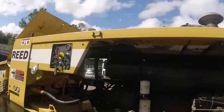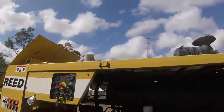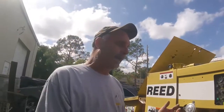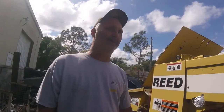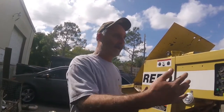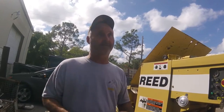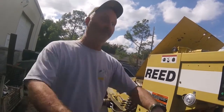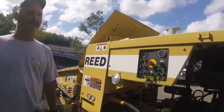That way it cleans, and you have the right pressure. The machine's running correct. Because what will happen is that at some point the pump's got to convert. It's called a point of regulation on a pump. It's usually about 100 bars, somewhere around 95. But when you run it at half speed, the pump now tries to convert for you. So now it's not asking for pressure, it's asking for volume. The machine is pushing 36 liters a minute, and you're going to overheat just by running half throttle, half speed.